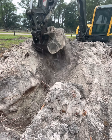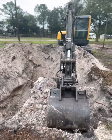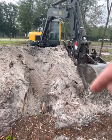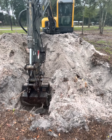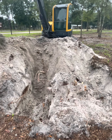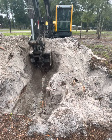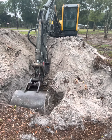You just go right on down out of sight. I usually dig deeper than what I can imagine that stump being — I would have went a little bit deeper than he did, but he's not wrong, that's just me. What happens is the tap root will form like a foot on them. It's close to coming out now. They'll form a foot — they go down straight and then branch out at the bottom. It's almost like a rivet. If you don't get that dirt dug out around that foot, you almost can't get them out without breaking them off. A root or stump this size, with a 20,000-pound excavator, you're just not going to break it off. So there is a way to do this without tearing your stuff up all the time.